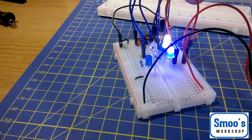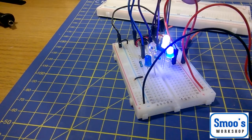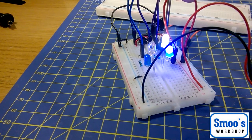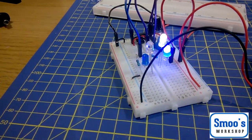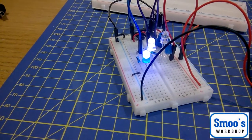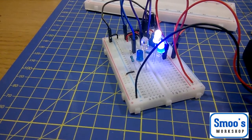Yeah, happy with that. I'll slow it right down. I've got my R2D2 circuit. And once I get it at the rate that I want, as I said before, I'll just measure what resistance that is, and I'll make a wee circuit board up with it. So I'm fair chuffed I'm getting there with my 555 stuff.